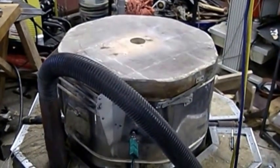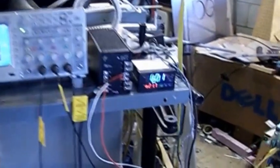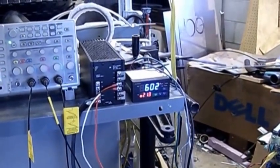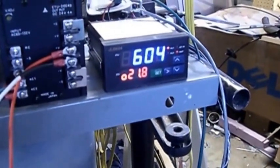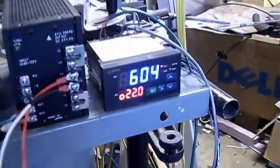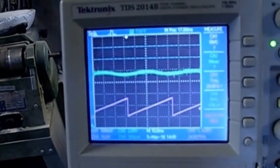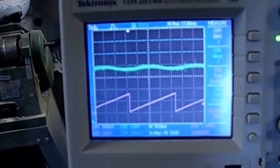The kiln seems to be working okay with the exception of one of the burners acting up a little bit - I'll keep an eye on it, but progress is good. Checking in again - we've just started ramping up after the quartz inversion temperature. I paused for about half an hour there just to make sure it didn't break anything. We're at 603°C and the temperature controller is now at almost 22 percent, up from 17. Everything's still working great.